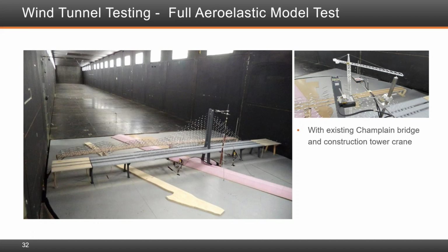Okay. What were the seismic design criteria required during the design of the main bridge? I can take that, Marwan. Because of the importance of the bridge, the owner specified it to be a lifeline bridge. At the time when we were preparing our RFP, the Canadian code was being revamped, but it wasn't out yet. So we talked to Dennis Mitchell of McGill University, and we got an advanced version of the new code, which effectively we embedded into our RFP. So we required performance-based design.